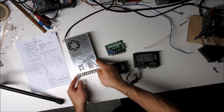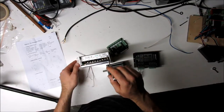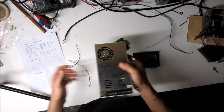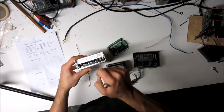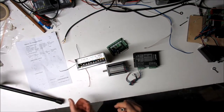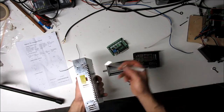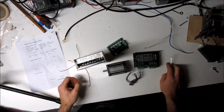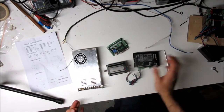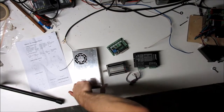The stepper motor is connected. I've pre-cut two wires for the power supply. On the front of the power supply you have 115/230V input selectable by a switch on the side, then your connections: line, neutral, ground, negative 36V output, and positive 36V output. For some reason this supply runs on 115V even on the 230V setting without affecting output — but always set it to your actual input voltage.